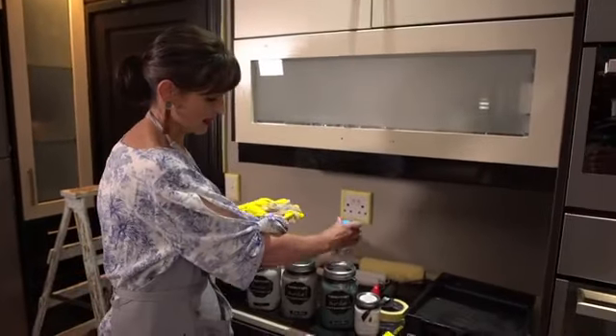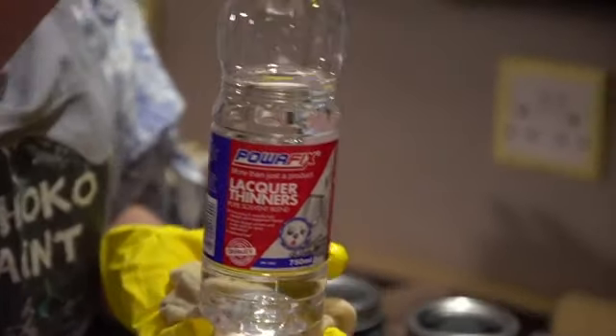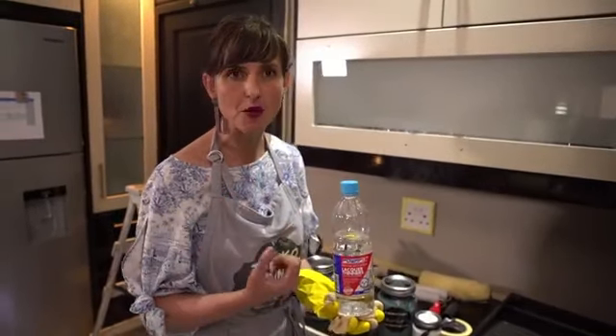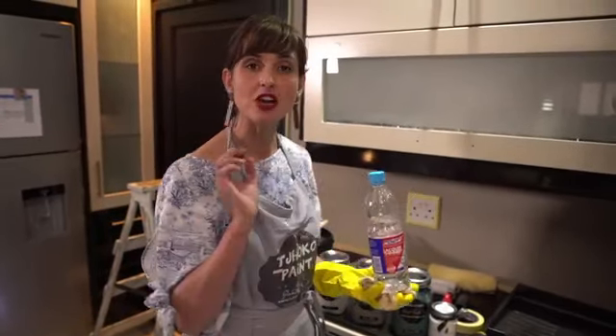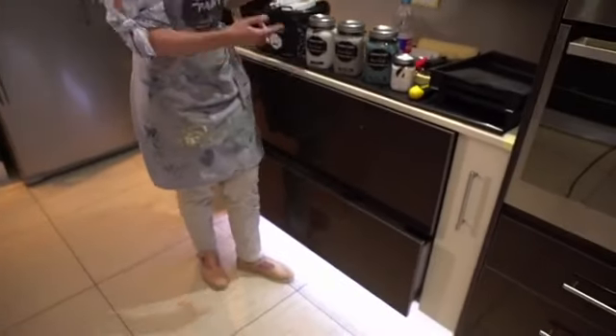Let's just look at the thinners again — it's Power Fix lacquer thinners, and honestly this is key to success. Clean well. The next very important step is to allow the thinners to dry properly — it will evaporate. Depending on the weather, it can take 20 to 40 minutes. We have a cloudy day in Gauteng today, so I'll allow the surface to dry for at least 40 minutes before I start painting. I've already cleaned these drawers earlier today. The thinners doesn't remove the shininess — you can still see the shiny melamine — but it etches the surface so the paint can actually grip.